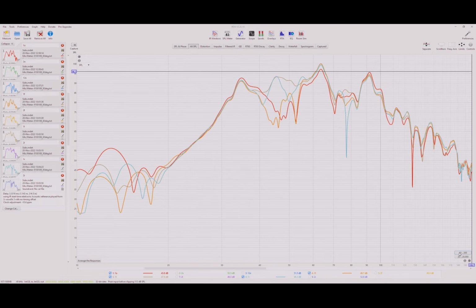No need to see very low frequencies. As you can see, even with 20 centimeters, they vary massively, especially in this region. If you could take only one measurement, you might think it's a huge dip here and try to correct for it. But in fact, just 20 centimeters away, it's not a dip, it's flat, even a kind of peak. So you understand that this is a very local problem you don't really have to deal with.